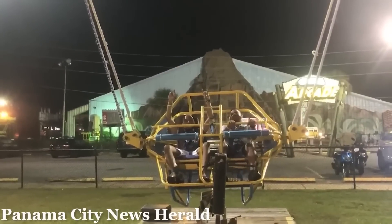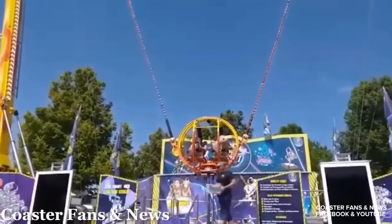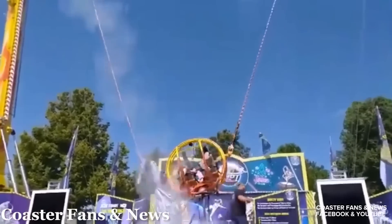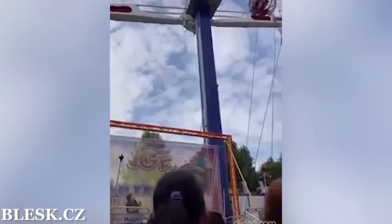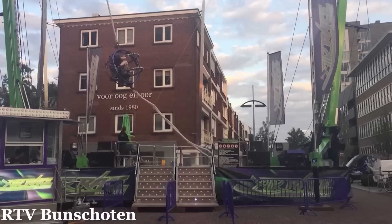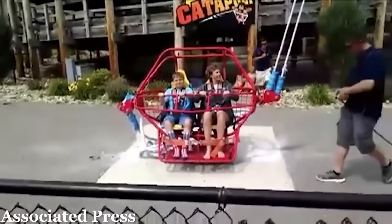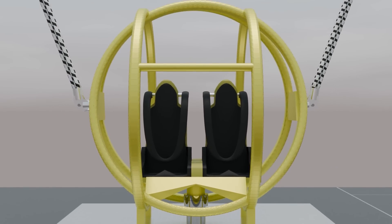This design is prone to multiple failures. One of the most prominent is the failure of the elastic section of the cables. As anyone who has played with a rubber band can tell you, elastic can only be stretched so many times before weakening. Most elastic segments on these rides are only rated for between 200 and 300 launches before they should be replaced. If an owner fails to do this, or if a manufactured defect is present in the elastic, it can fail while riders are on board. When this happens, segments of elastic are sent flying near the riders, and if a rider capsule has been released, it can be sent flying into one of the ride's towers. Ride operators nearby also run the risk of being hit by the broken band or by the capsule. Some manufacturers have tried to remedy this by adding a second band to each side of the rider capsule, but this has had limited success, as band snaps often release so much energy that they destroy the band next to them. Secondary elastic bands can also be easily overwhelmed and snap after suddenly having to bear the full weight of the rider capsule while in motion.